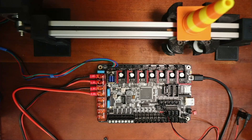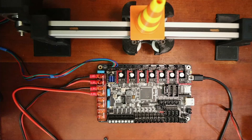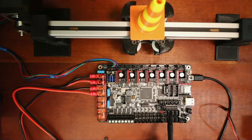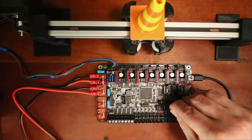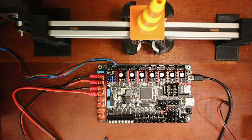The other way to fix direction is in software. I'm also going to remove the endstop because we're going to use sensorless homing. For sensorless homing you have to set the jumpers down here - you have X, Y, Z, and a couple others. The X jumper is right here, so I'm going to place this jumper in to configure it for sensorless homing.